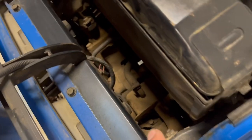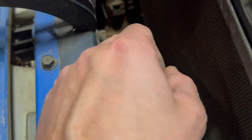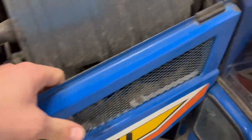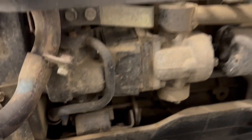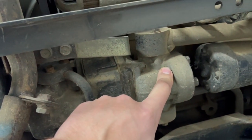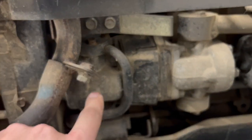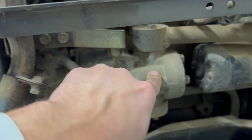Over here is the power steering. As you can see it has a filler cap over here, and there's the pump. You can recognize the steering pump like this because normally this tractor only has a hydraulic pump. This is the starter motor. But if you have power steering, it also has this pump over here — this one is for the power steering, and this one is for the hydraulic.